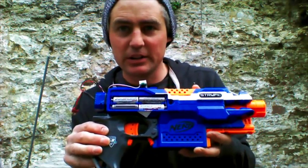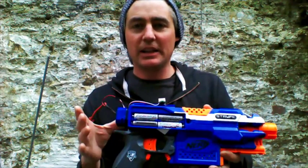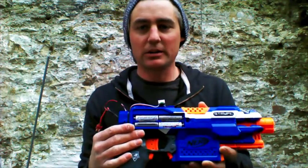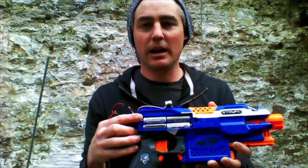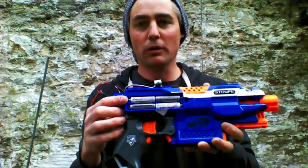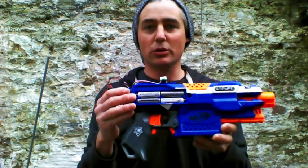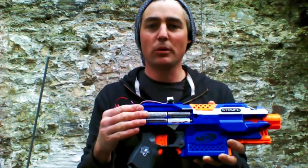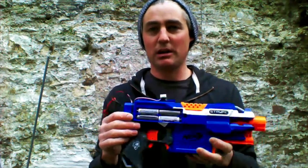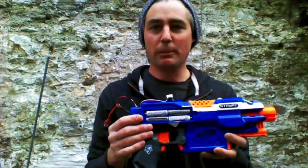First up, the two trustfires in the battery compartment with two dummy cells. They're giving me an initial reading of 8.1 volts on the voltmeter at rest. These have been peak charged on my Nitecore i4, as have my IMR batteries. These were brand new — I had to buy four cells to get two that worked, ending up with one dud out of four. The quality is awful. I bought medium-price Ultrafire cells because people say they use them because they're cheap, and these state a nominal capacity of 2300 mAh, which is way over what they actually are.